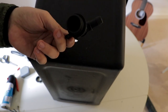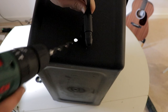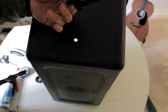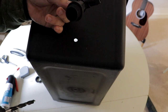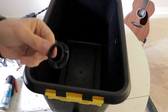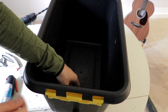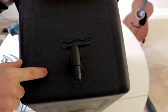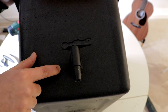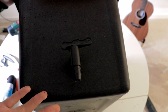The tap diameter is quite a bit bigger than the initial hole I drilled, so I'm going to keep making the hole bigger until the tap can fit through - but being careful not to drill it too much, otherwise there'll be gaps, leaks, and the waterless garden won't work at all. I've drilled my hole and put the tap in; with the nut end I'm just screwing it to the inside of the tub to secure and tighten the tap. Now I'm going to run a water test to see if there are any leaks before carrying on, because if there are leaks once the gravel, felt, and soil are in, the whole system probably isn't going to work.